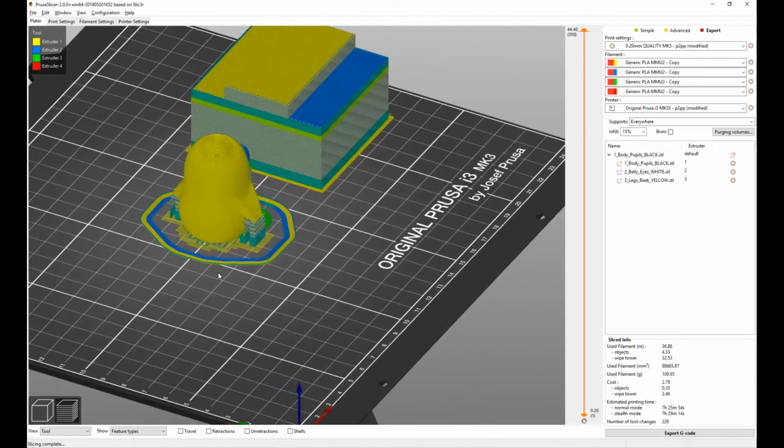So to avoid that, you can use soluble support. That is an awesome feature that I use a lot. That's basically my primary usage of the Palette. I don't that often print in multiple colors, but I use PVA for soluble supports a lot. If you download random models that aren't maybe made for 3D printing, they often need a lot of supports, and that can totally ruin the print quality. And if you're a designer and make your own objects, the design freedom that the soluble support gives is just awesome. You can make the models exactly the way you want them, rather than having to work around the limitations that FDM 3D printing gives. So overhangs isn't much of an issue anymore when you use soluble supports, other than of course the extra cost and time it adds to the printing, but the quality is very high when you use that.